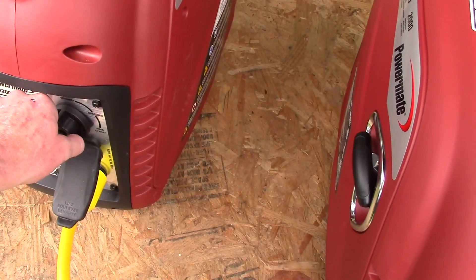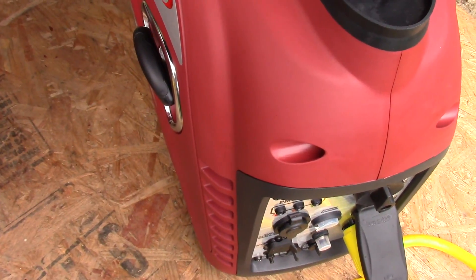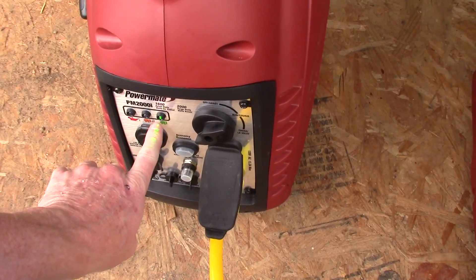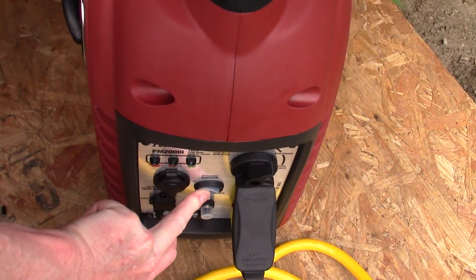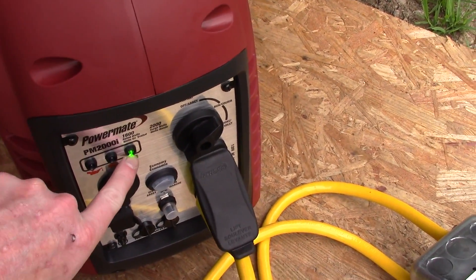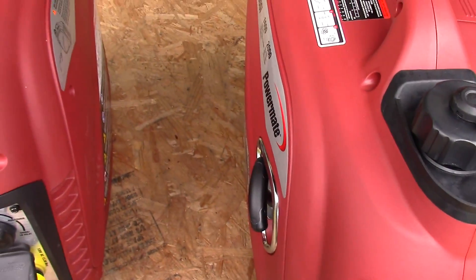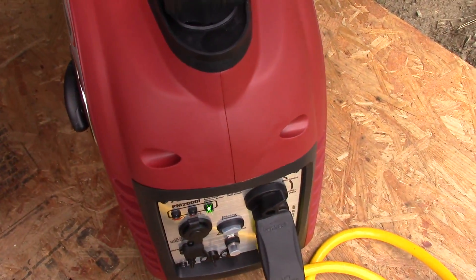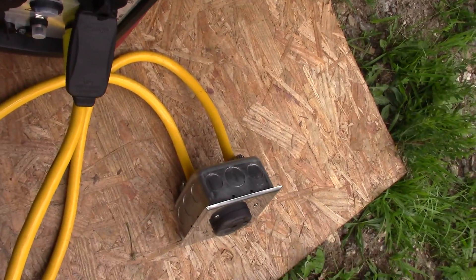I've already got them warm, so basically all you need to do is turn it to run and fire up the first generator. Be sure that both plugs are plugged in — you don't want to be firing up a generator with only one plug connected. Once this turns green and it's up and running at full speed, you can turn on the second gen. Make sure economy mode is off, give it a pull, it'll start, go through its cycle, and sync up — now you're at full power. After they're running you can turn down into economy mode. For shutdown, make sure you don't unplug one of these cords while they're running — turn both units off first, then unplug.